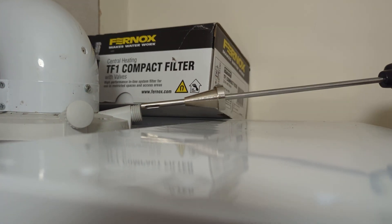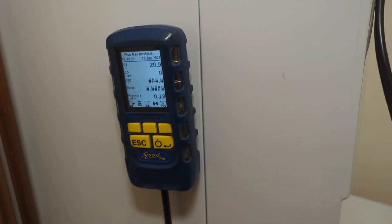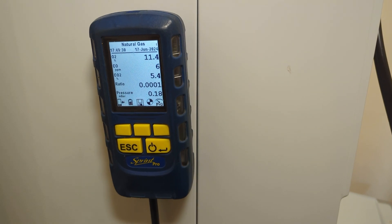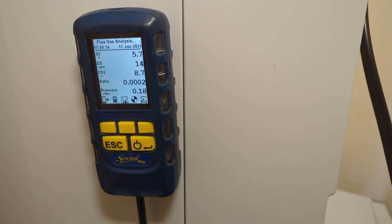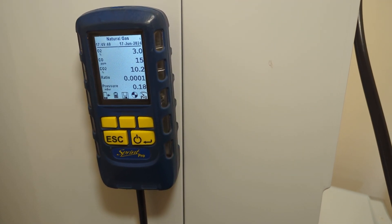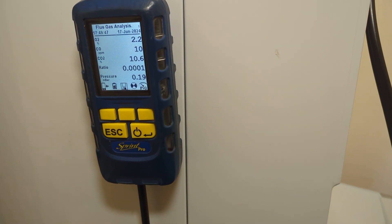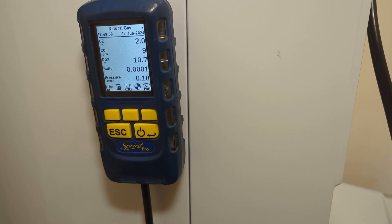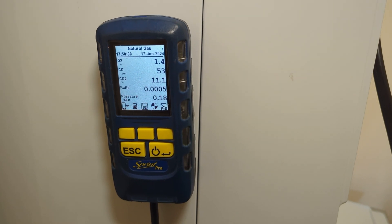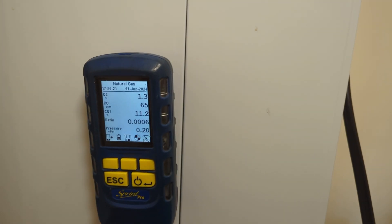On this occasion I'm actually doing it wrong, so I'm going to show you what not to do. I looked at the screen and saw the flame picture drop to the lowest, so I presumed it must be in minimum — but it's still showing S93, so it's still in calibration mode. That's why these readings are a little unusual: you've got quite high CO2 for a Vaillant boiler, and it's going high then low again.